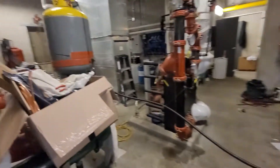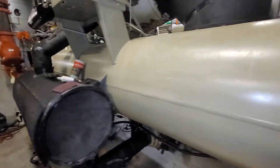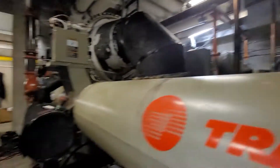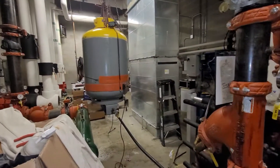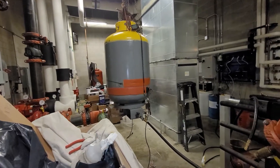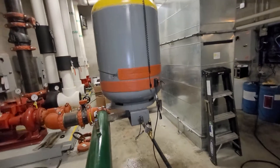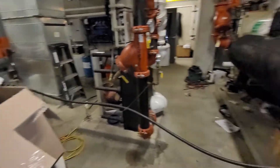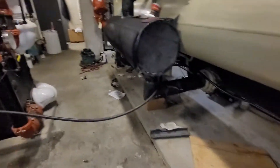I don't have a scale hanging on the tank today because I've got another tank hanging on the other chiller — I'm recovering vapor over there. Based on the way this sight glass is flowing, I'm thinking I'm gonna get all this liquid in in a couple hours tops.